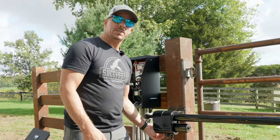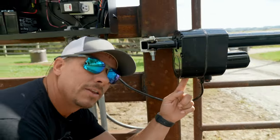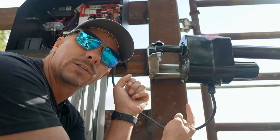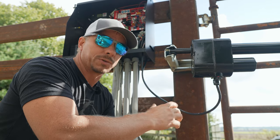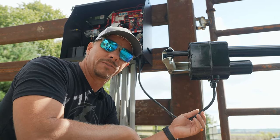We do have limits on these. There's a little plug right here that you pull out, and there are some screws so you can adjust the open and close limits — not just one limit, but two: one for open and one for close, which is really the way it needs to be. All the gate operators that we install have that feature.